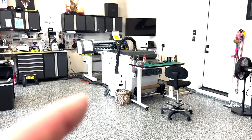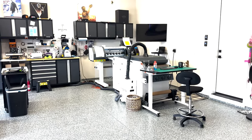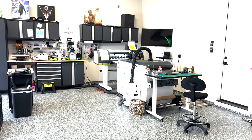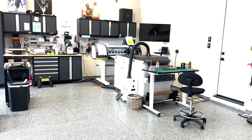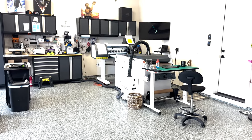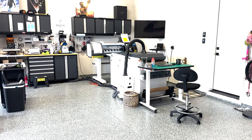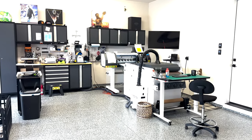But that was another problem with Ricoma. It was mind-boggling, because the install tech called their office and said, hey, can you check the air purifier that we have in the shop and tell me if it's doing the same thing? And the guy goes over and looks at it and says, oh, no, the bottom blower is not on either. Well, yeah, because you're plugged into a 110-volt outlet when it's 220.